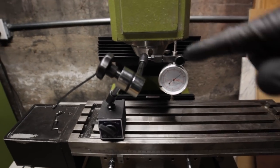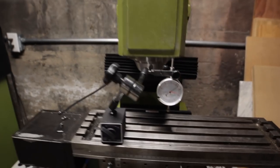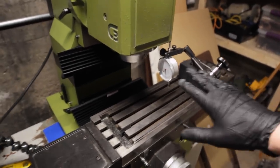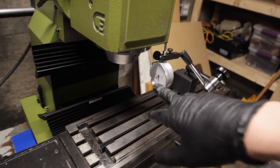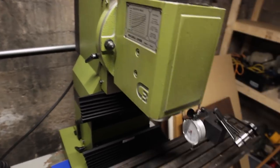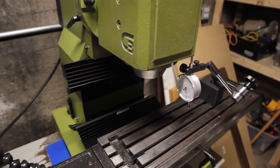And then I'm gonna tram in the cutting head here because there's these two holes that let you pivot the head. So we're gonna tram it in, see how it goes. What I'm gonna do is, I've got this set under here. It's kind of rough, but it'll work. And I've got that set to zero and I'm gonna run the motor back and forth to see how far it is off. And then I'm gonna loosen these, tap it which way I need, get it straight, until it's perfectly level with the bed. Let's do that.